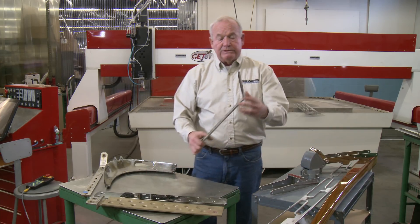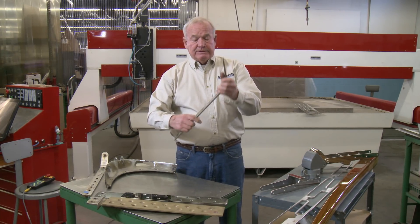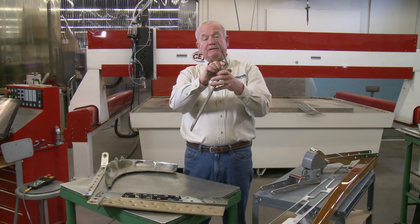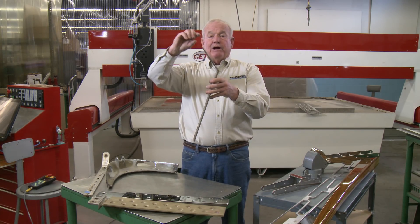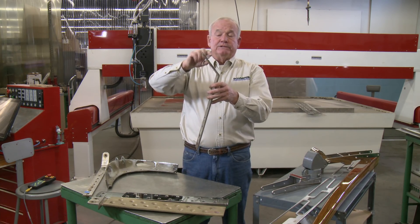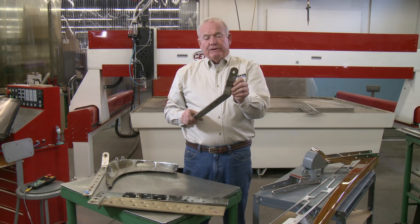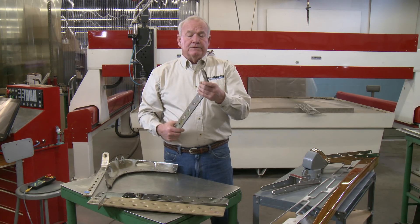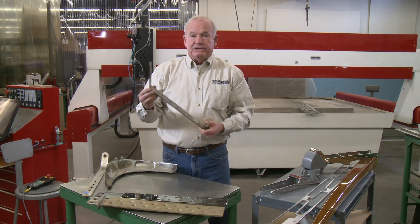The backstay chain plate was in pretty rough shape too — you can see all this blackness and under that is a lot of corrosion. This actually was coming up the transom, took a turn at the transom into the fiberglass and then was routed through the teak. The problem was water coming down off the stay got in and the teak stayed wet. This is actually a pretty corroded fitting — it's intergranular corrosion, which creates its own stress once it gets started. It's going to be a very weak part, so we could have seen a failure out of either the stem head or the backstay chain plate.